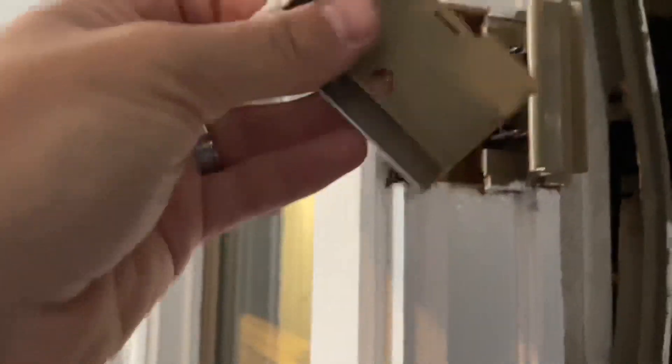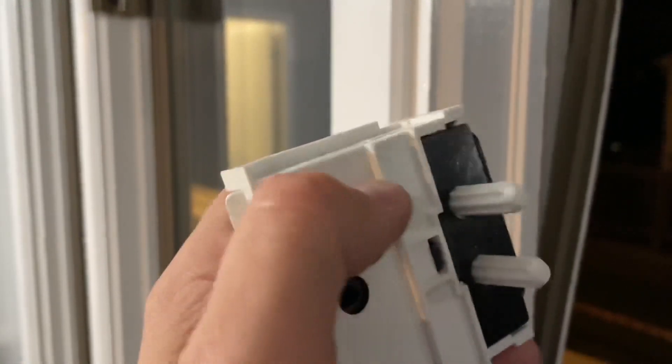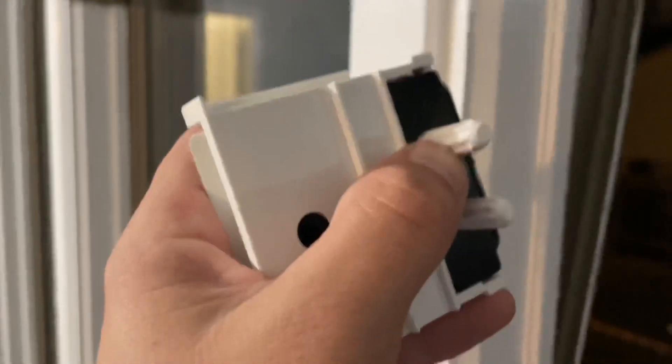As I said, it might just fall apart on you after you unscrew it. The lock has two insert pieces that go into the wall, so you need to get those out. The problem is that since it's so corroded it might break off. So get your spackle knife and slowly, gently pry it out — try to get it out just like this. You see how it's coming out slowly without breaking it?